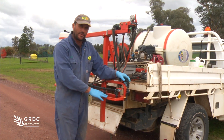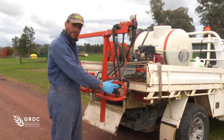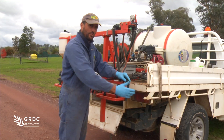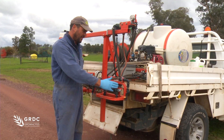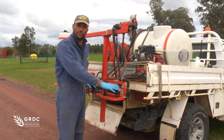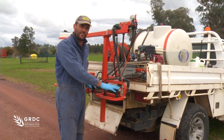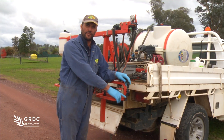When we set this rig up to go and do some fence line spraying, we have 50 centimetre spacings here. We have to adjust our flow rate and width to match what's happening with this rail. At 50 centimetre spacings and an O3 nozzle, if we were doing 3 bar and 12 k's that would be 120 litres of water to the hectare. So what I want to do in this exercise is set this up to do 120 litres of water to the hectare.